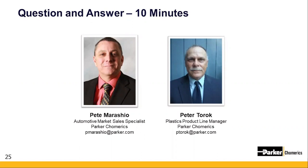Okay, so we have a question about EMI shielding for a conductive plastic. Essentially they're asking, what kind of shielding can you expect from conductive plastic when compared to die casting and coatings? Roughly speaking, a die cast housing is going to have the most EMI shielding, about 100 to 110 dB. A plastic housing is going to get you quite a bit, but not anywhere near that much. That would be in your 75 to 85 dB range, which in our experience for most of these types of housing applications is really what the customer is looking for. And coatings can, depending on what you apply them to, whether on top of a conductive housing or a non-conductive housing, usually do somewhere around 75 to 90 dB shielding, and even more if it's on top of a conductive housing. So back to you, Brian.